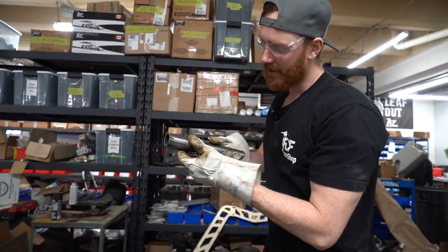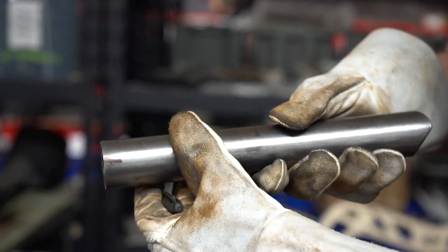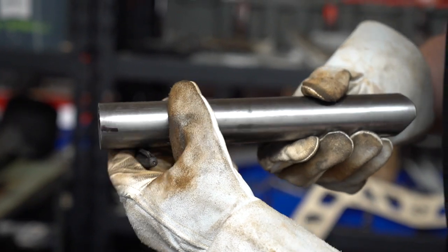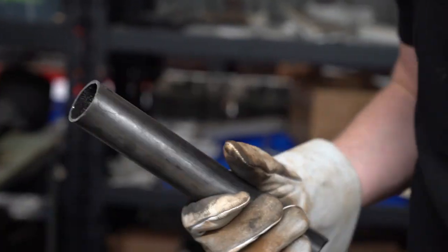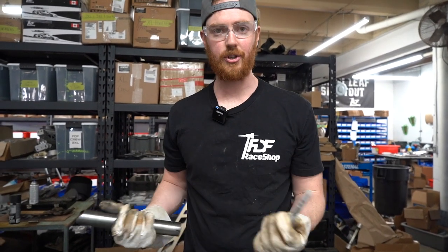When I put this on the lathe, I basically center this with the center of the hole saw, so I just rotate it and make sure the hole saw goes straight through this way. Everything works out. There's not really any way to mess it up unless you don't scribe it properly — so a little tip and a little trick.